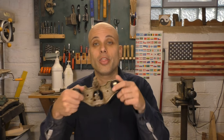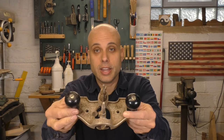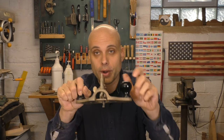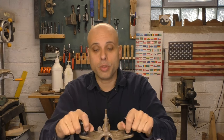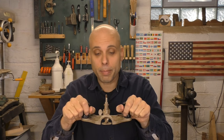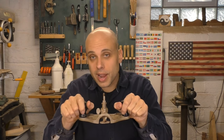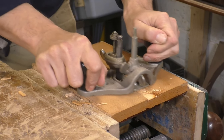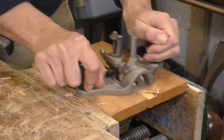What do traditional woodworkers do when they run up against this problem? They grab the router plane. Here is the metallic Stanley version and it is an amazing tool. You can see it's got a flat bottom, a pair of handles, and the cutter sticks out right here. You can set it to any depth you want so that the sides ride on the top of your joint, and this cutter comes right in the bottom — you can clean up that joint, adjust the depth, and make it dead flat and perfect. It's a high precision tool.